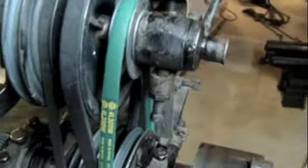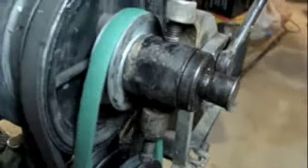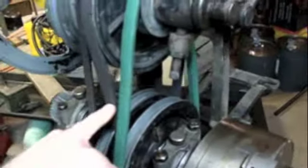I've got to get this belt on the right pulley. Okay, now all belts are taut. Still slipping too much. So we're going to have to get a 29 and hope that's not too loose. You can see the amount of deflection in this one is very little, same with this one, but this one's deflecting quite a bit compared to the others. This belt is too loose.